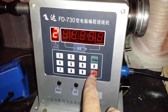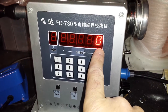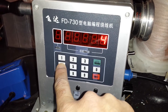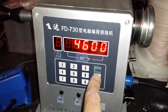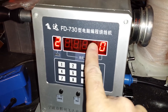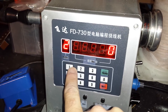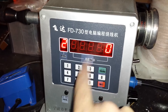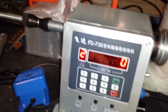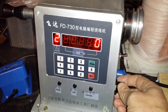Then press the red button to set the number of turns — the display switches over to the turns display. Enter the number of turns, so 4,600 in this case, then press the red button again to confirm. It flashes up a bright zero on the display to confirm it's set. Program two is now set to 4,600 turns.